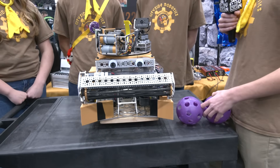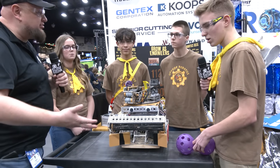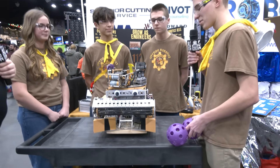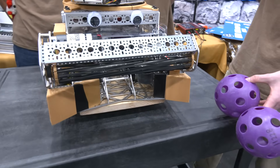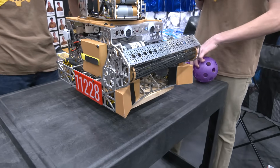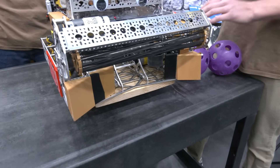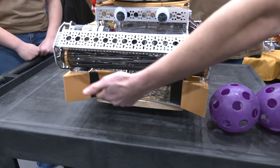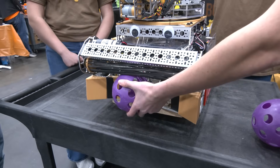As you're testing different rollers, what made you come up with doing more of this rubber band design? Why was that successful versus some of the other things that you tested? We decided on a rubber band roller because it expands to give us that compression that we really like. It also funnels on its own — we see how it's kind of offset. It's angled this way so that it will always feed it in moving alongside with these funnels, so it always moves in and it's really fast on the center as well.